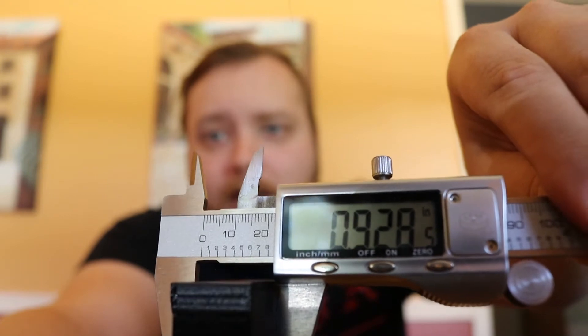The height needs to be 0.918 inches, which translates to 23.3 millimeters. This is about the sixth or seventh part I've printed in various shapes and sizes. I'm printing in PLA on my Orion. If we go ahead and measure this, you'll see I've got it pretty close — it's at 0.928 inches. We need to be at 0.918, so it's a little too big. 0.928 translates to about 23.5 millimeters.